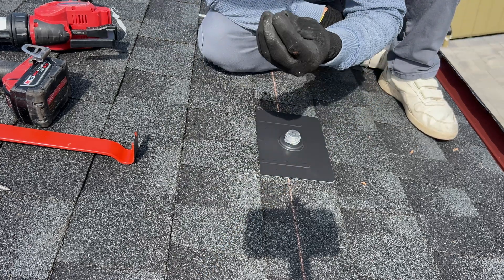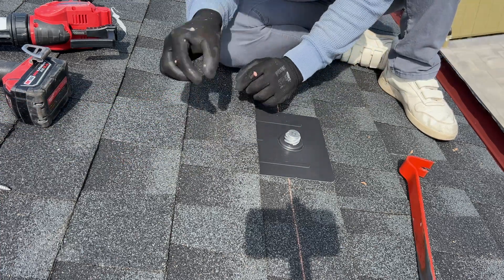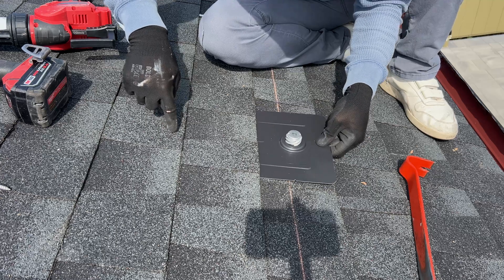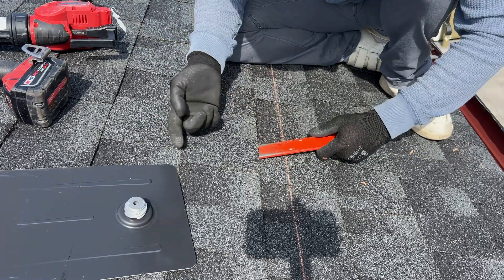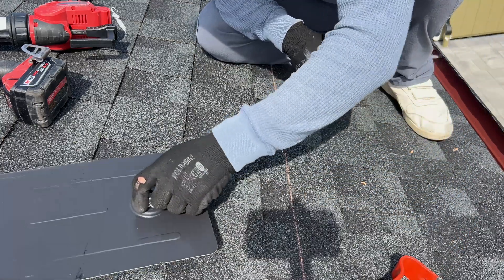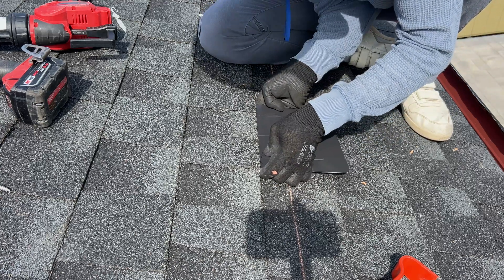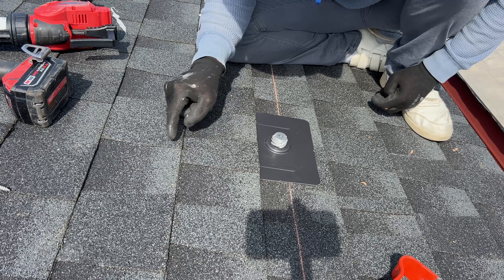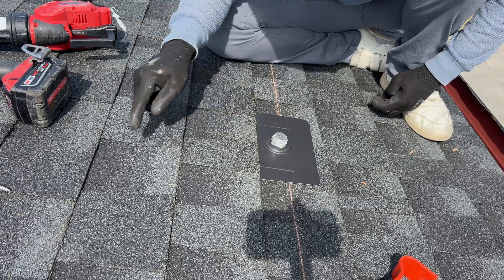However, we see that the glue is really good on these tiles because it's fresh and hard to remove. A lot of this glue is going to stay on the pry bar after removing them, and all of this area is nicely sealed. So what we can do is just find where the nail is. In our case, center is somewhere here. Now we can insert the pry bar and lift — it's going to tear the shingles and the nail will be below this layer. We lift a little bit, and now all of this glue stays in place. The nail is going to be behind the metal, and in my opinion it's a little bit better than lifting these shingles and sealing with sealant.